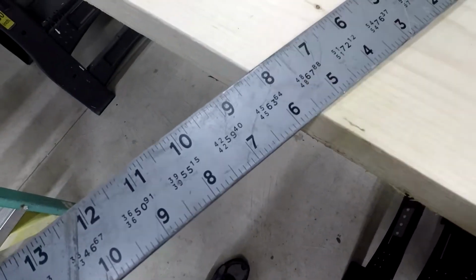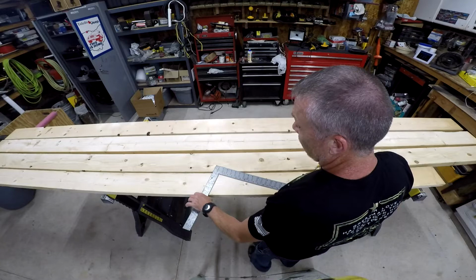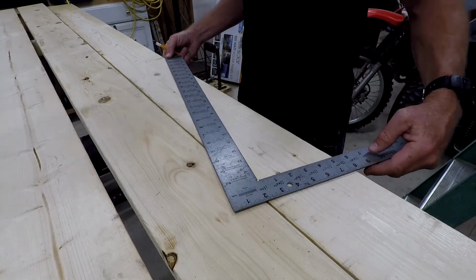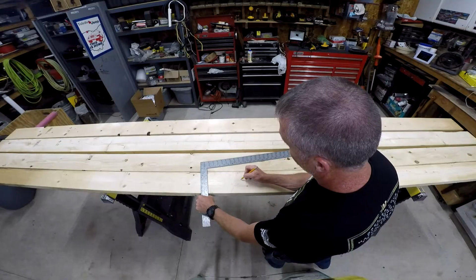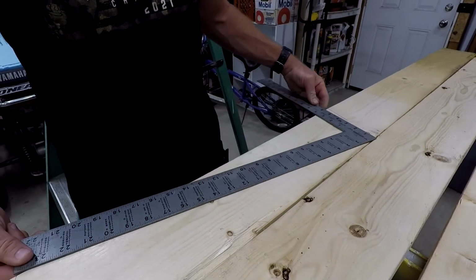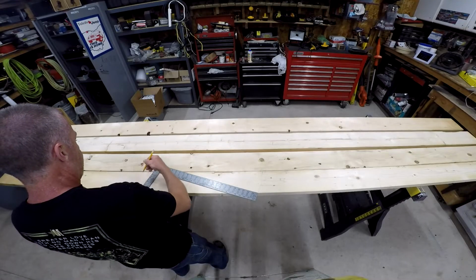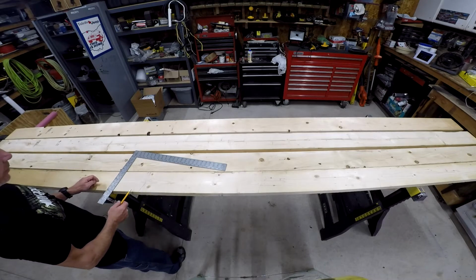So I put the 24 on the edge on my line. I put the 8 on the edge. And I mark. Now I'm at 48 inches. Slide down. 24, 8, and mark. That puts me at 72 inches. And mark. There's 96 inches. That puts me at 8 feet of run,